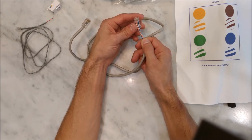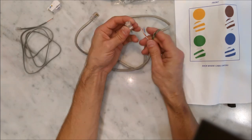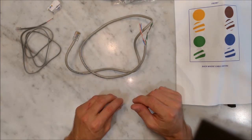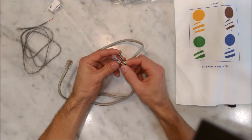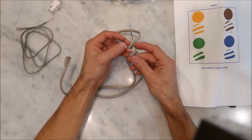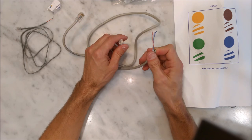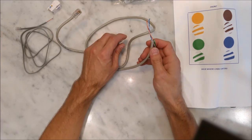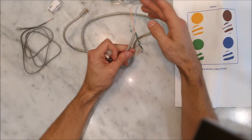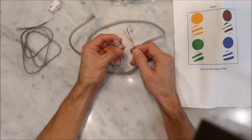—this will give you a 100 megabit connection throughout your house even though you only have four wires. If you have eight wires wired up correctly, you will have up to a gigabit connection. Go check your phone closet and see what kind of wiring you have. If it is twisted pair wiring — even if it's just two pairs of twisted pair — or if you're lucky you have four pairs, that can be converted to ethernet in an hour or two.